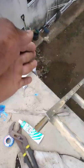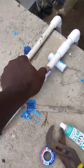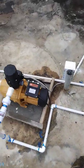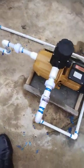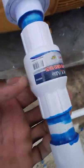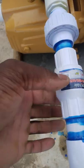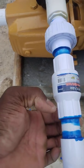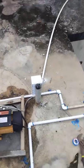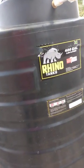The water comes down from the smart head through the non-return valve and then goes down to your house. There's another lock-off right here — I like adding lock-offs so you have options in case anything goes wrong. For the non-return valve: anywhere you see a shape that looks like a cone, that's the direction the water flows. If there is no arrow, you can use that cone shape as an indicator if you're not a pro-level plumber.